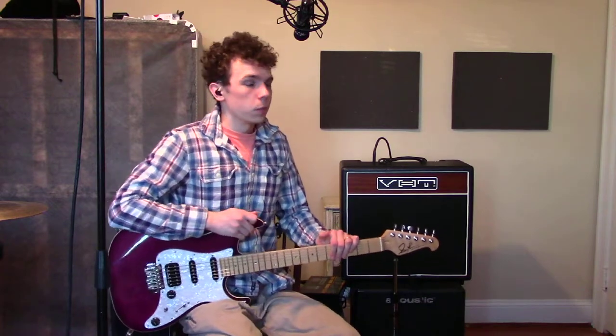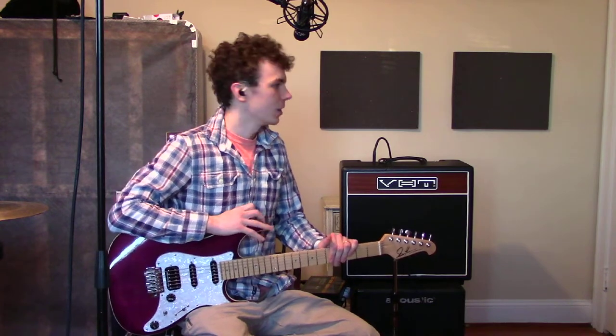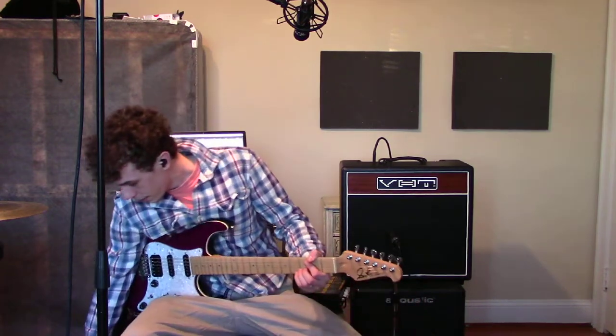From what I've read on the internet, it's pretty much an exact replica except for very minor changes here and there, and I don't even know where. As far as I know, there's like one or two differences between this and a real Fender Tweed Deluxe, and I just have to say it's fantastic. It really is. To give you a quick rundown on the specs: it's 12 watts, two 6V6 power tubes, one 5Y3GT rectifier tube, two 12AX7 preamp tubes, two inputs, two channels, a Celestion G12H30 speaker, which is a fantastic speaker, and a high-grade 11-ply finger-jointed birch cabinet, hand-wired in the USA, and it's good.